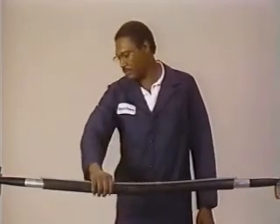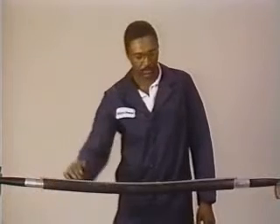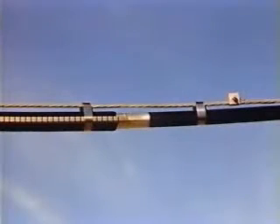When the channel is cooled to the touch, the cable may be moved or re-pressurized. If the installation has been on aerial cable, support the repair area to the strand with lashed cable supports. This WRSS installation is complete.